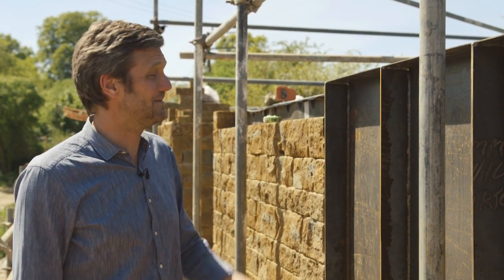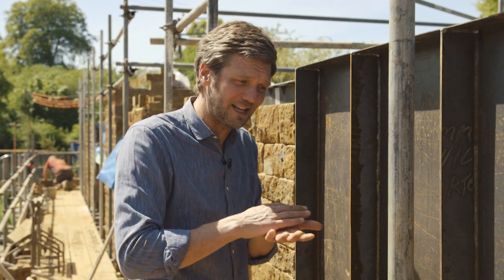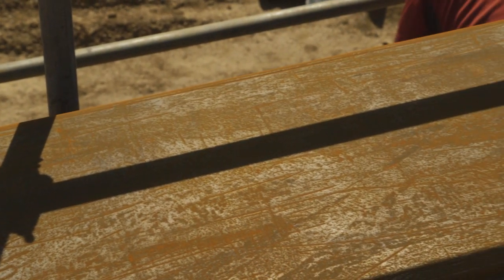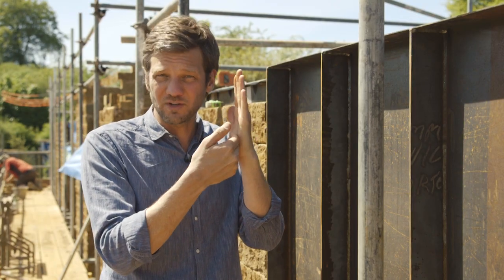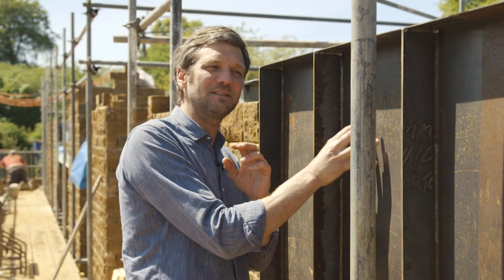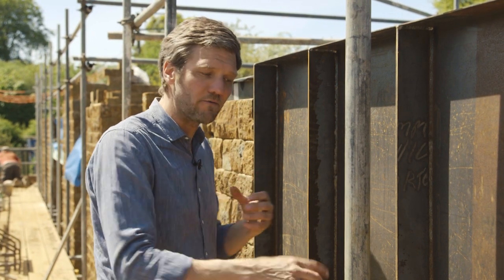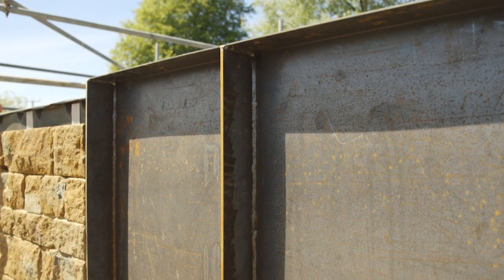I'm really so pleased with the way that it looks. It's meant to be very industrial. The whole idea of Cor-Ten as a material is essentially an alloy, a mild steel alloy. What it does is it rusts — it creates a rusted layer on the surface, which is what normal steel does. But the difference is that once normal steel has created a rust layer, it starts to break off from the surface, exposing new uncorroded steel, which then gets corroded and breaks off, so it slowly gets eaten through. With the cocktail and mix of metals in the Cor-Ten, once it's created that surface layer of rust, it doesn't flake, it doesn't expand and flake. It's self-weathering — the oxide layer becomes a protective coating and you just get left with a rusty metal finish, which is what we're after.